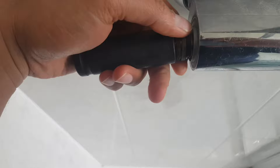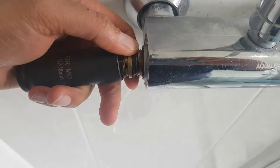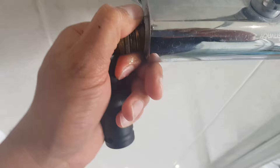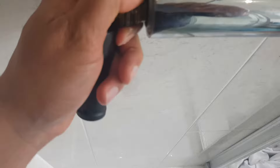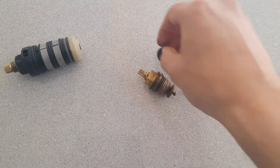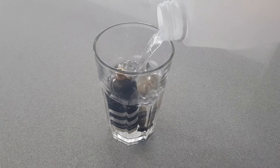What I found was that as I was trying to take it out it was quite tight. There's effectively a rubber seal which is probably the valve that gets stuck there, and as I pulled it out the valve actually got stuck in there, which caused me a little bit of an issue and meant I had to fish it out. I used just the smaller Allen key and it was easy enough to fish out and also easy enough to pop back on. You'll see the compression joint so you'll be able to work out where it actually lies.